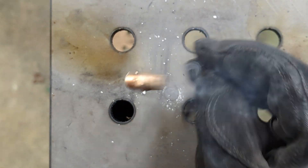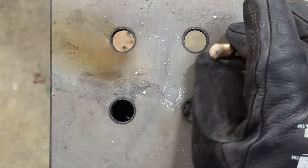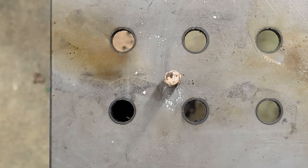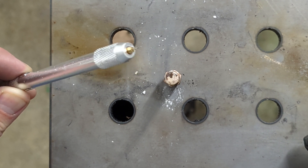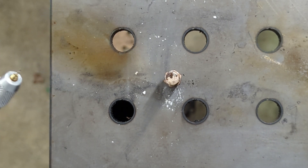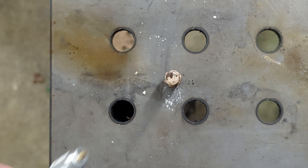Effectively what I've done is close that up to a point where I can take a drill bit. This is a number 74, which is about 0.6 millimeters. Right now I'm running a one millimeter hole, but that's probably going to be about right — I want to take it down just a bit and see how it reacts, then decide what the final version is.